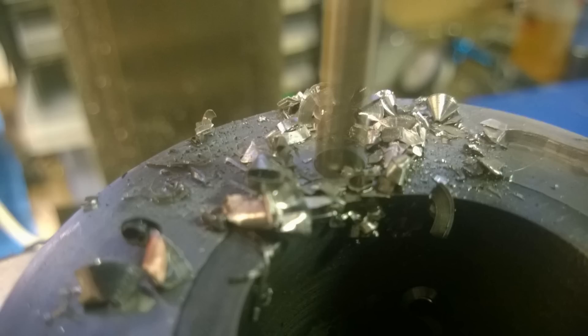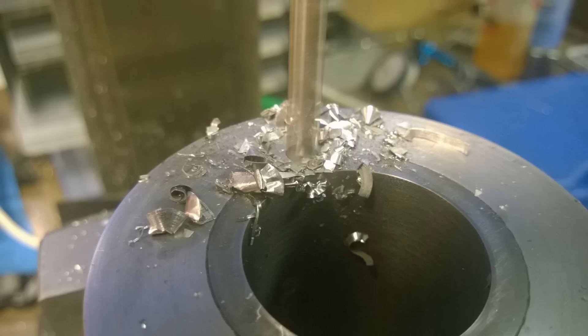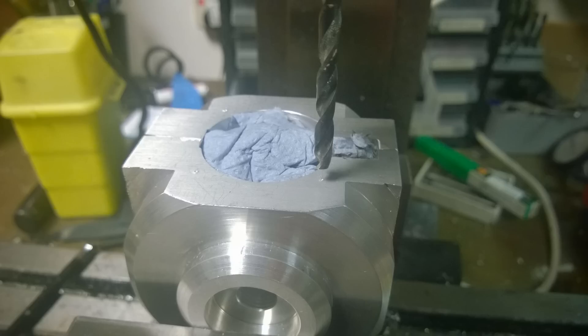Instead of putting a dowel pin I could also do that, but as you can see there are little tiny conical chips coming off. There's nothing much to see here — you just go further and further down, take your time, always back the drill out and peck away. I use water to cool the drill bit. Here you can see me drilling and tapping the center punch marks on top of the cases. I've filled the cases with tissue paper just to stop swarf falling down inside.